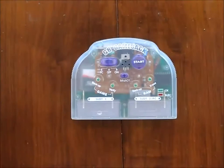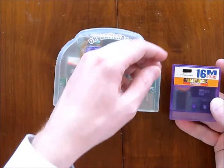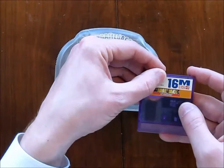Of course you can program your own Game Boy games with this cartridge. Originally it came with a 4 megabit game jack cartridge, but this happens to be a 16 meg one, with a switch for auto, which has its own menu ROM built in. Also a switch for MBC 1 and 2, or MBC 5, which are the Game Boy's memory bank controllers.